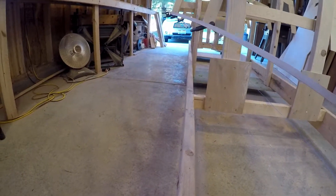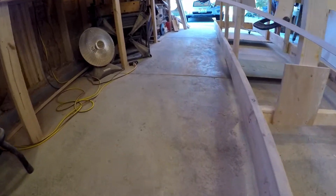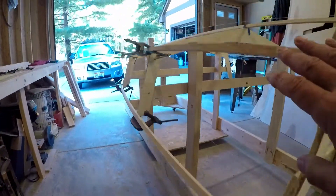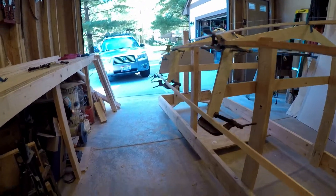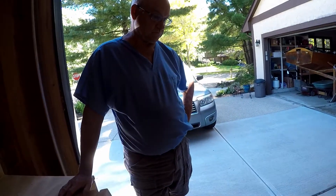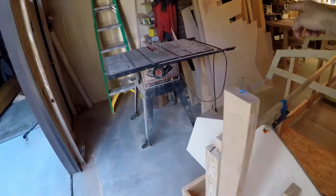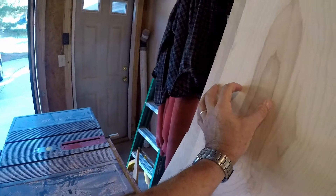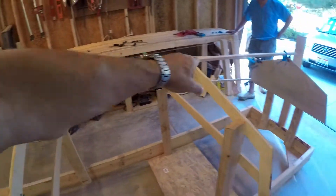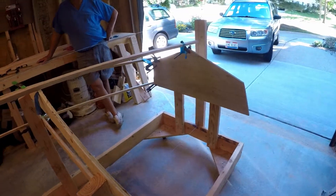You're following the shear line now as well as the chine, and it looks like a really pretty good curve. Both the chine and the shear are looking really good until they cross over R4 down there — it looks like it's going up a little unnaturally. We're probably going to need a new transom. Not the end of the world — lose a little wood. I've got plenty of this birch half-inch to work with. The dagger board trunk will come out of this, and two-and-a-half-inch eight-foot strips will be joined to make the keel. Plenty of wood to make another transom.